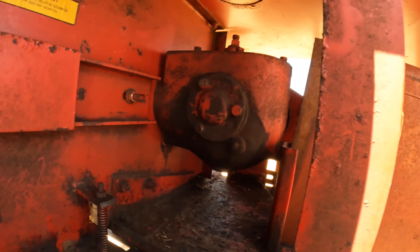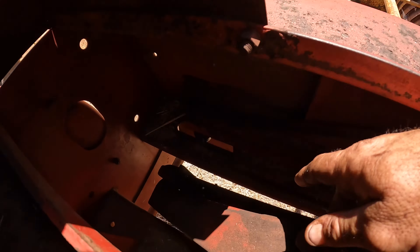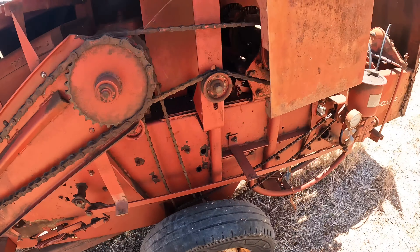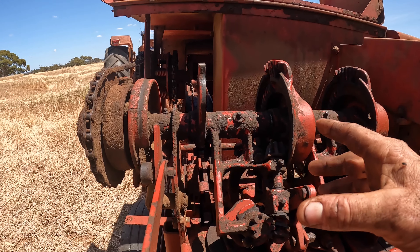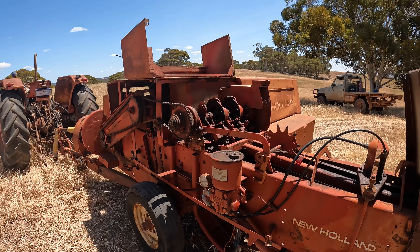The next thing is to go around and grease it - there are grease nipples all over this machine. A couple of important ones: always do your universal joints because otherwise you will blow them and they're a pain to change. There's one down in here that's really important too as it has a fair amount of load on it. The knotters also have a lot of grease nipples and are really important to do. They only turn slowly so you won't wear them out quickly, but once worn out there's a lot of work to rebuild them.